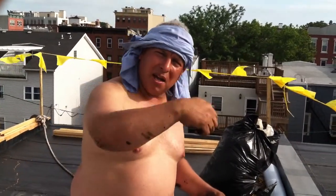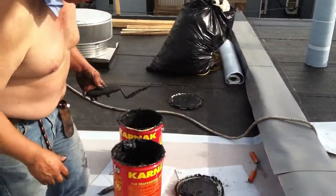The whole idea of leading a drain is to prevent the water from backing up if there's ever a clog and getting under your roof system. You can't have a very sustainable roof system if you're going to have — eventually, and you will — a clogged roof drain that ends up penetrating all the insulation and making it garbage. Come on down to my level and let's take a look at what we did.